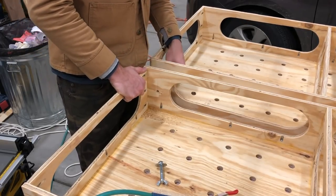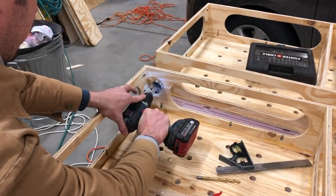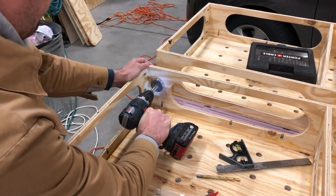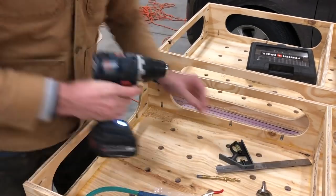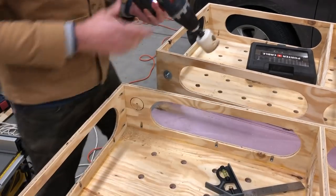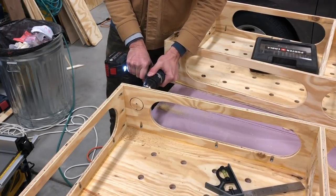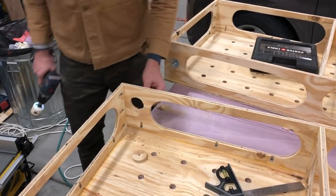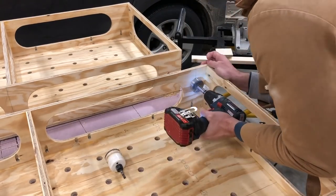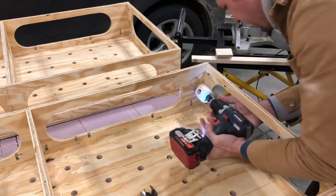But the Paulk design takes it one step further by allowing a design that keeps the washer, the bolt, and the lock nut all together. Here, I'm drilling a 2-inch hole with my Forstner bit to make a clean cut, and then backing it up with my hole saw to pass it all the way through. That diameter is going to pass just halfway on that 3/8 inch hole, as you can see, creating a notch. Then it's just a matter of doing it on the other side. I decided to keep mine on the same part of the assembly table so only one side would carry the bolts.